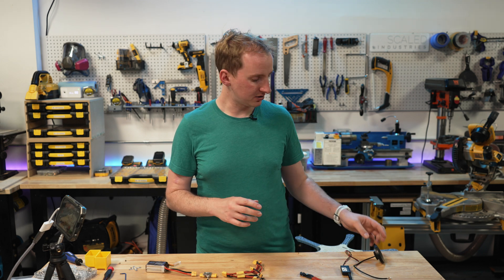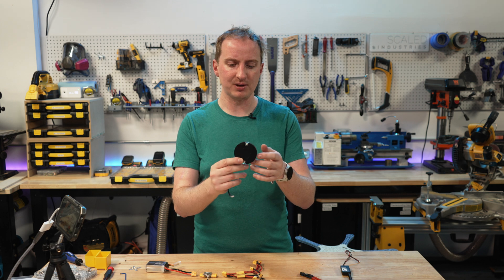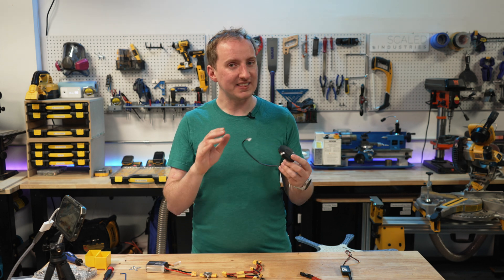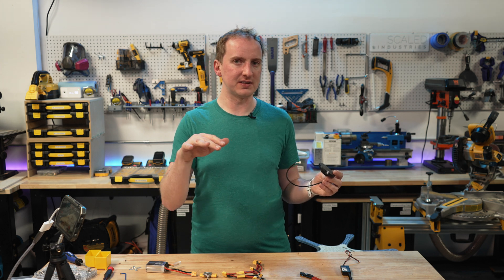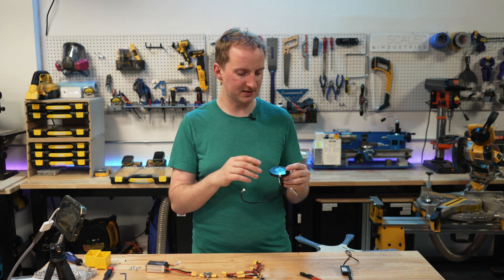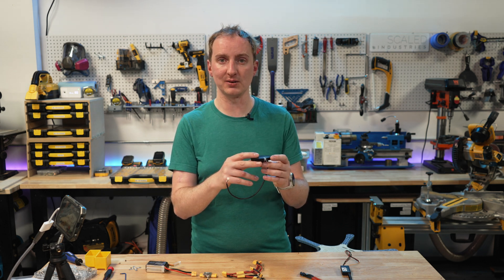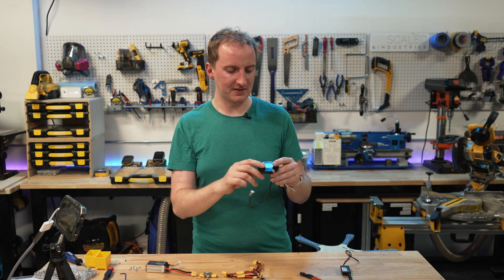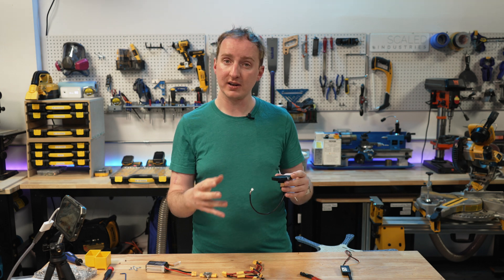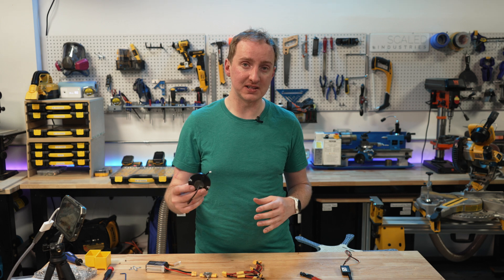A few other pieces I think are pretty essential. First of all, a GPS — this is a HERE 3. Your flight controller can work with GPS, or it can just go off inertial sensors, but then it will just sit there drifting and not be entirely sure where it is. So you generally pair it with a GPS like this, so when you tell it to hover in position it will actually hover in position rather than slowly drifting to one side and hitting a building — that kind of thing does happen. This also has some nice lights so the flight controller can flash them when it's happy, unhappy, or very sad — like when it's crashed. I've seen that before.